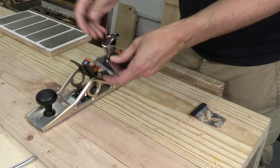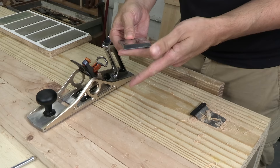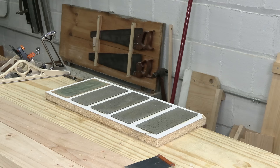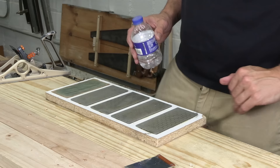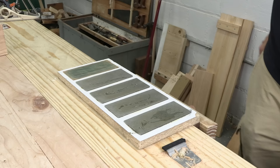I cannot be the only one who thinks sharpening a blade on both ends is a bad idea — especially when getting the blade out means turning the plane upside down and letting a heavy, razor-sharp, double-ended blade fall into your hand. Each blade does have a little aluminum cover that attaches with magnets, which really helps with the safety issue. But we still need to sharpen. A2 steel is very hard, so I need to use diamonds. I reviewed a set of cheap diamond stones — now four for $17 — and I'll put a link in the description.